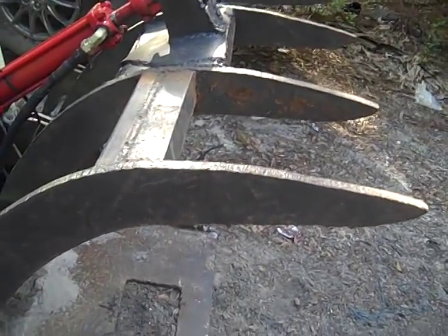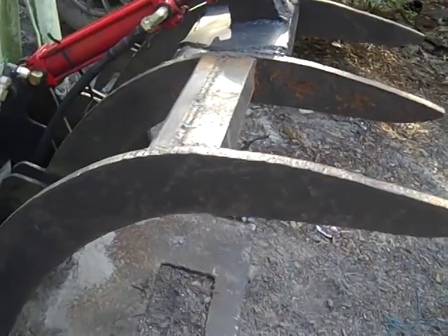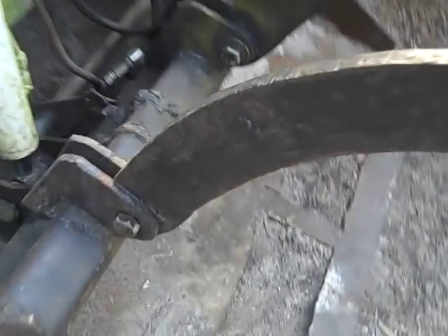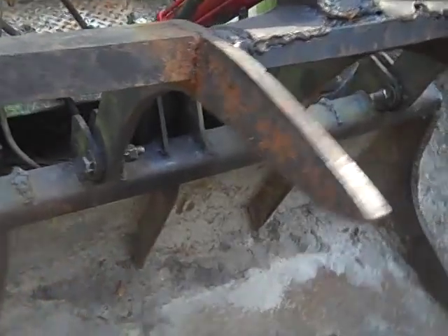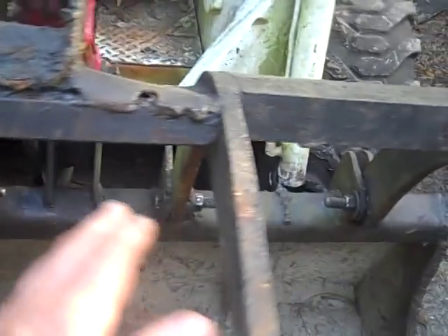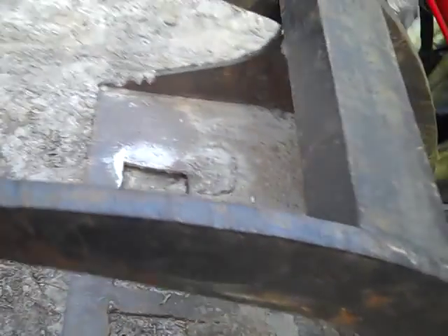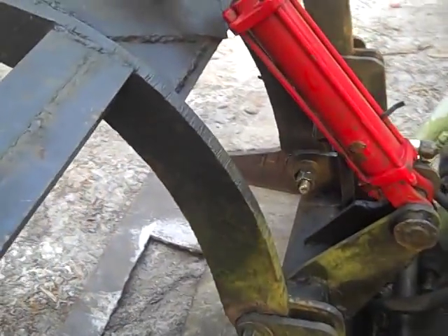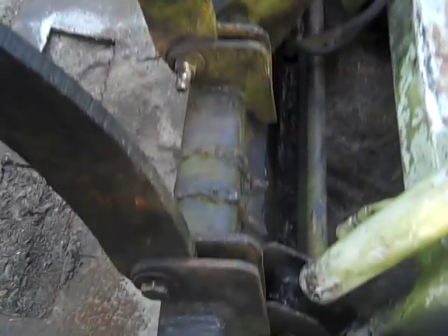I took a cardboard box, shaped it out and drew the pattern, then cut it with a torch. I welded some ears right here, put in some bolts, and made my own grapples — because they're very expensive to buy. I put it forward here for my bucket and it works really, really good. When you clamp them down they do the job picking up logs or whatever you need to pick up.